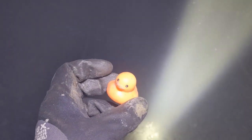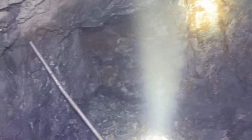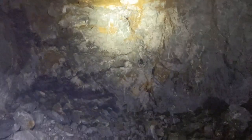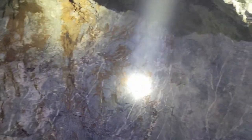Oh, you did a lot of this. I guess an explosive is missing. So please bear with the beeping. It's the low alert on a carbon monoxide meter. That's below the 8-hour MSHA limit for a full shift. It's just notifying us that it's present. We've been ventilating out with the bazooka blower and wetting down the face for a bit. Barred down, wet down a whole bunch of stuff, because wet muck will fall a lot more easily than dry muck will. It's kind of crazy. You put a garden hose on it and you'll have stuff the size of a grapefruit start falling off the face.